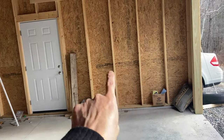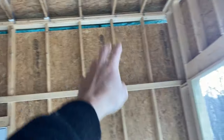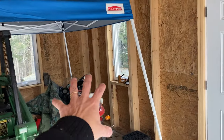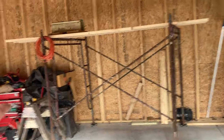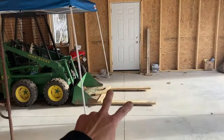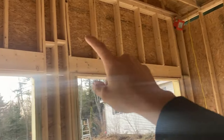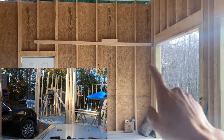Let's go inside and look at the structure. This is a simple build — with two-by-sixes you're allowed by code to go two feet on center, and I did that because these trusses are also designed two feet on center, so the trusses line up with the posts. I did double doors so we can come in and out through the property, and I put windows on this corner where I'm going to have a little office and desk. I'm also planning storage up above for equipment and materials alongside the cars. The headers on the garage door wall are three individual heavy headers put up individually.